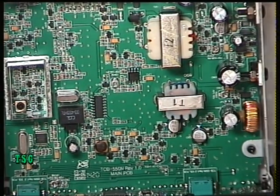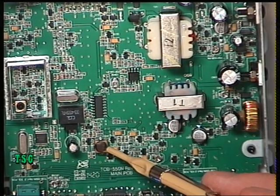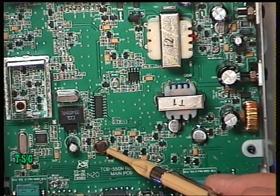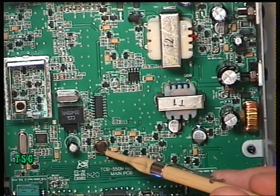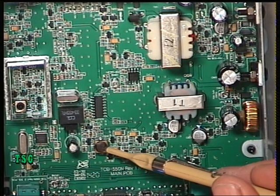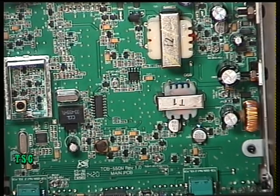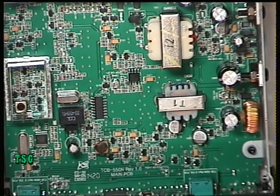Normally we'd do the detector. The FM detector is going to be there and it's been wax-filled, and I've got no reason to suspect that it's out of alignment in any way. That's actually quite a good policy, because you put them in the car and they rattle down the road and you end up with the detector going so much out of adjustment that you get distorted voices on receive. So wax-filling is a really good idea and I can't fault it.